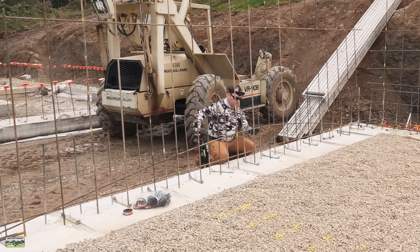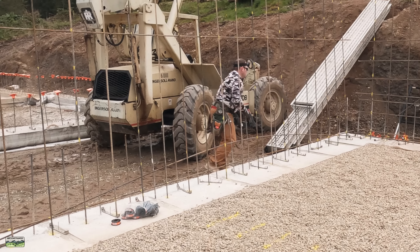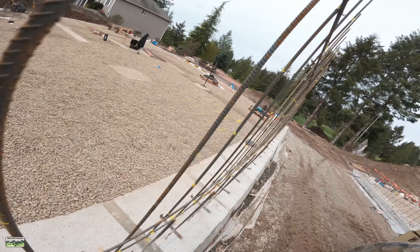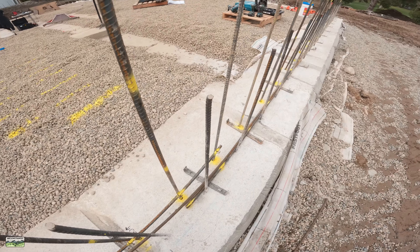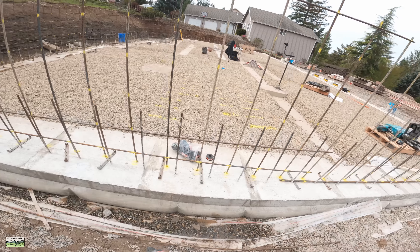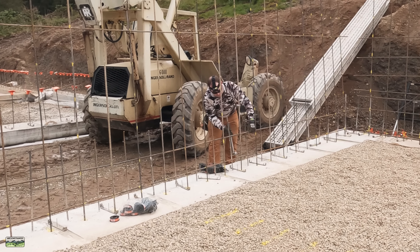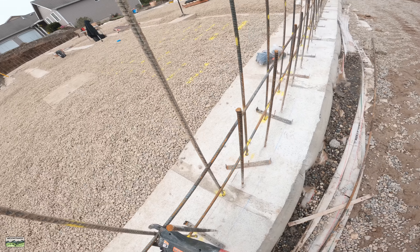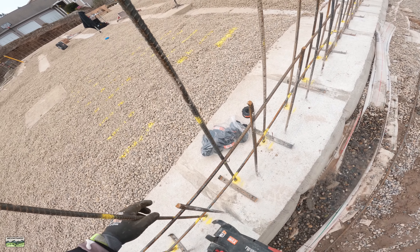It can be a little challenging because I've got the verts already in the concrete and yes they move a little bit when we pour. This is actually the foundation we poured in the pouring rain — when it rains we place concrete. You can see how I have to kind of thread it in there — not a big deal. I think all iron workers would laugh because they have to put in steel that's heavier, bigger, and a whole lot more of it. But you can see on these walls we have a lot of rebar — big footing, tall walls.